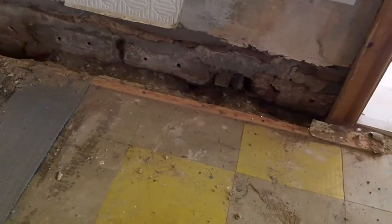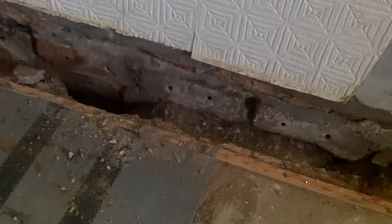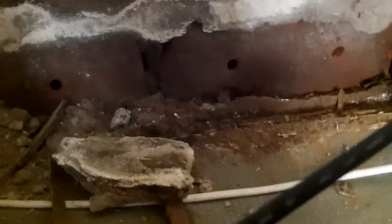What are we going to do about all this? Well, the floor is sealing moisture — we've got a floor surface here with lino tiles on it that is sealing moisture, nothing can get out. All the moisture that's coming in through the rubble under the floor is being pushed sideways into the wall, and you can see that the walls are actually quite wet. There's dampness all around here, it's just generally horrible, and it goes right up — if you look at this wall here above two supposed damp proof courses, the wall is quite sopping wet. So the damp proof courses don't do a damn thing.